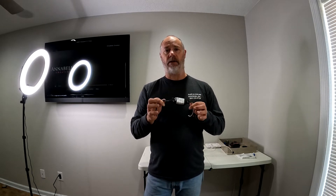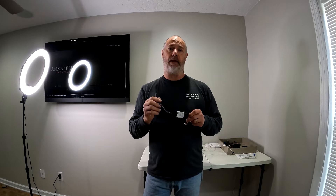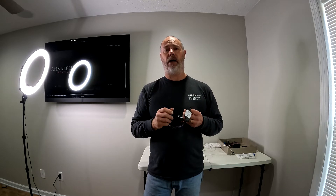Unlike a wireless smoke detector, this covers every smoke detector in the house that's wired by the electrician. In South Carolina they're all wired in series, so if any smoke detector goes off in the house, this relay will trip and set your alarm off also. What it doesn't know the difference between is a dead battery and a smoke detector going off, so you can set a relay delay in your system — though it's not always long enough depending on the type of smoke detectors you have.